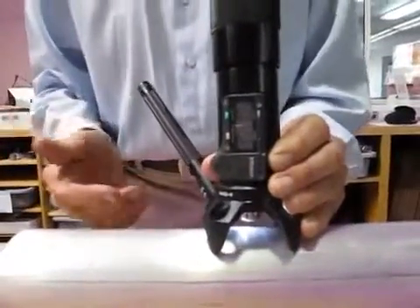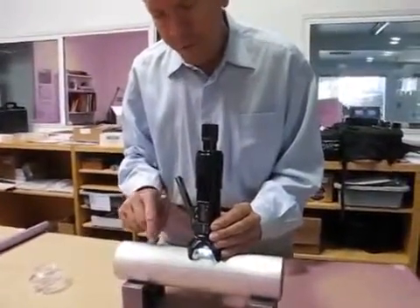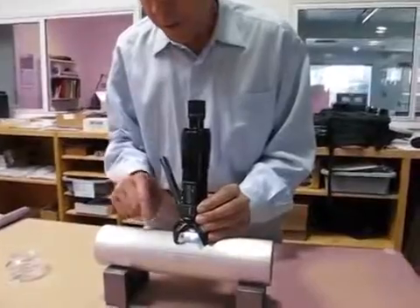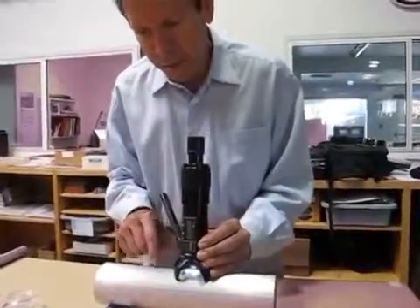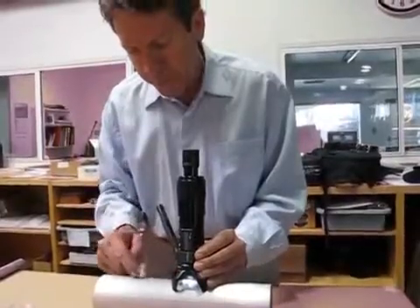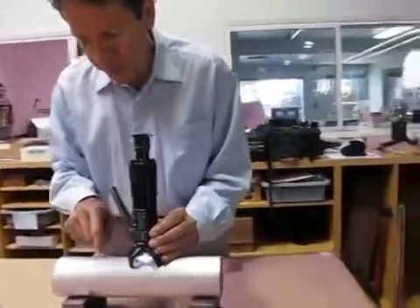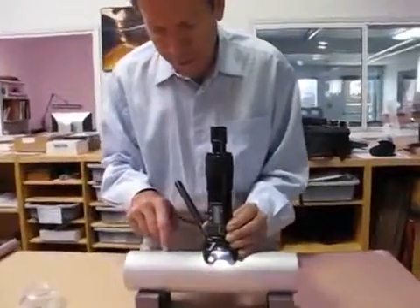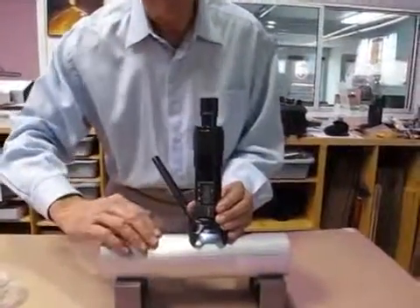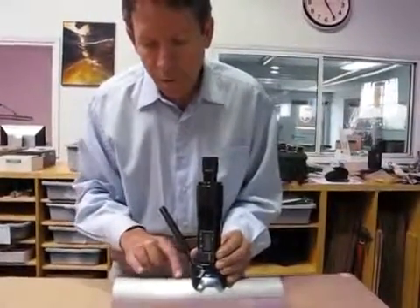This shows how you can use the micrometer on round shafts. When I pick my good surface next to the scratch, I'm going to the left or right along the top of the curve and then down into the scratch. Left or right and then down in — because if I go perpendicular to the axis and then down in, I'll introduce error due to the curvature. But if I go left to right along the high point, I will get an accurate measurement of the depth.